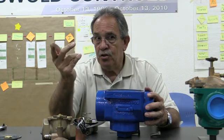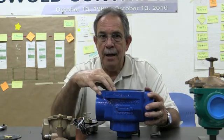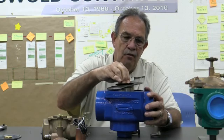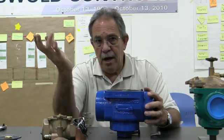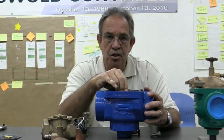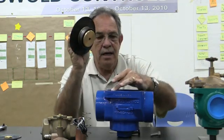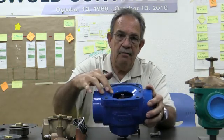You could have iron in your soil, you could have iron in your water. It really depends, and a lot of reclaimed water has iron in it. So that could be an issue. If you don't exercise your valve or have a winter type program where you're turning the valve on and off maybe once or twice, maybe three times a week, just to open and close it, you're going to get this part of the diaphragm attaching against this ridge in the valve.